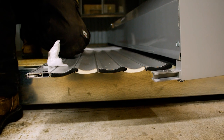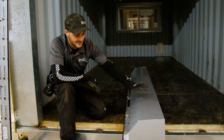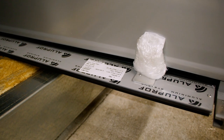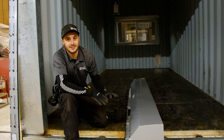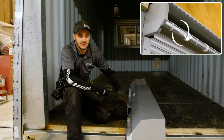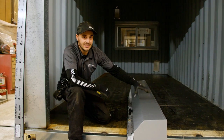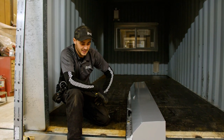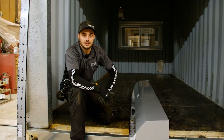The doors come pre-wound — you can see it wants to coil back around the coil in the header. It does have these stops, which stop it from doing that. When you remove this header, just be conscious of what you're doing. If you need to increase or decrease tension, the way you do that is you actually just move the coil around and around, and that will either tension the spring inside or release the tension. They are all set at the factory and they've typically done them right. The only time you'd need to adjust that is if you're adding an extra door seal, which added resistance to the door going either down or up.